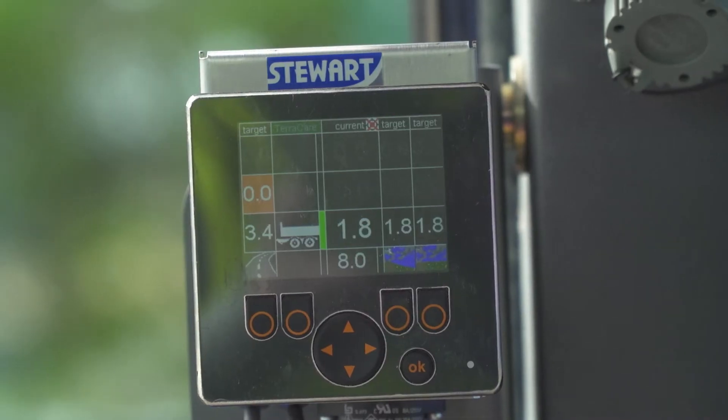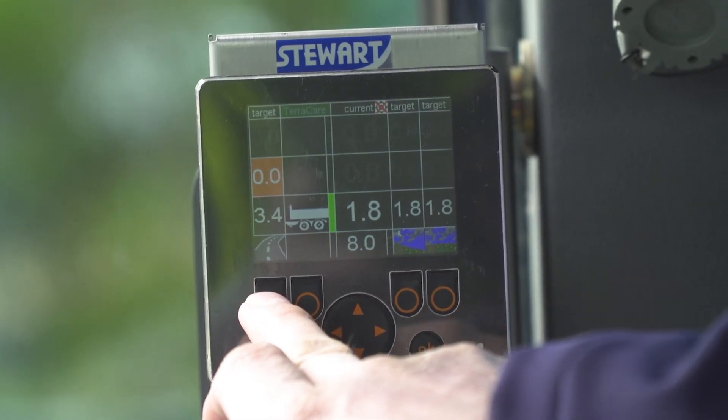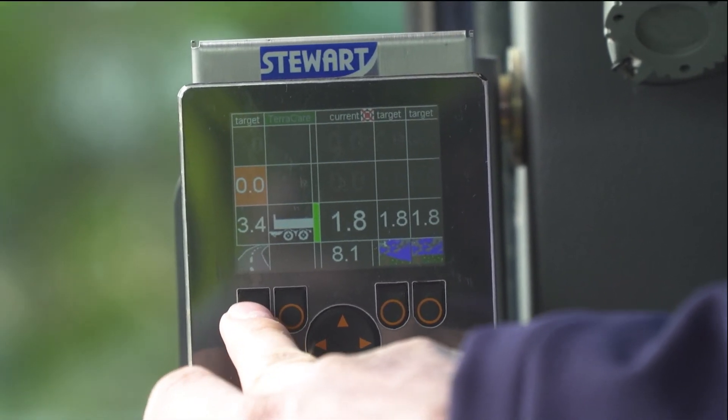To re-inflate the tires — we've been driving on the field for the last 10-15 minutes filling up the trailer fully, we have 18 tons of load, and our pressure in the tanks is about seven and a half to eight bar. So the moment we want to go out from the field, we press the road button and that will take us from 1.8 to 3.4 bar. Again, it's just a button press away. Let's see how quickly it takes us from 1.8 to 3.4 bar.